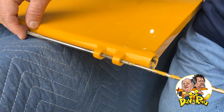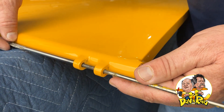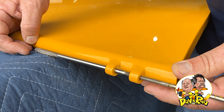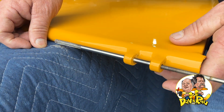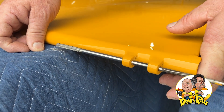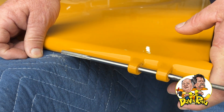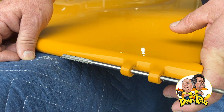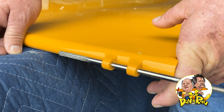I'm just going to be supporting it so we don't rub any of the paint — no big deal. You could use the plastic like we talked about. All right, here we go. Now let's hold a little bit of pressure on that horizontal so that he can pull it. You can see it making its way through there, the shank itself. Pulling a reamer is always the best way to do it with a tapered reamer, because it finds its own center so that you don't bore the hole off center. Ron's pulling it through there.